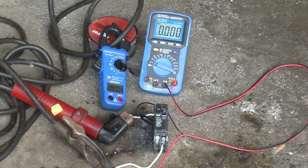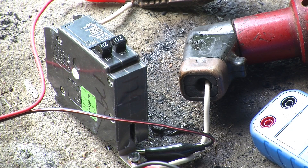Just for fun, let's hook this across the unlimited arc welder — plugged right into 240 volts — and end up with a startup current in the hundreds of amps to see how the breaker responds. Essentially instantaneous, and that's what you would hope — that's magnetic tripping. What we saw before would have been thermal tripping. You can actually see a spark coming out of the back of the breaker — a little ball of plasma was generated when the circuit breaker opened with such a large current across it. That's the end of this video; hope you enjoyed it, see you next time.